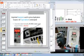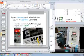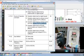Yes, source of operation by RS485 communication port. Now this communication port, as I told you, I have already done that. You can find the Modbus communication video in the description of this video. I've already made a video on how we can control the stop, start and jog using Modbus communication. This is very important, very effective. And in this case also we have keypad stop effective as one option, and keypad stop ineffective as the second option.